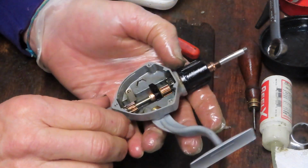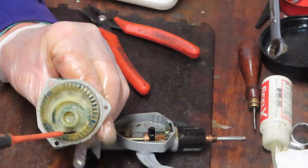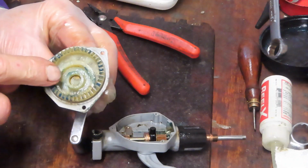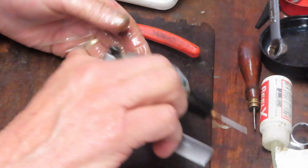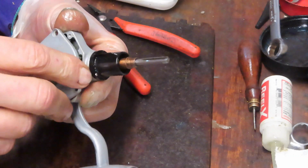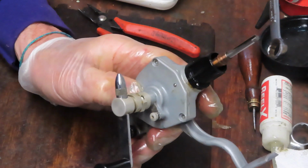Okay, we've got a yoke assembly. We've pretty much lubed up everything that's internal to this reel. What we want to find now is this is going to match into this groove right here with that grease on it. That's going to be our eccentric, and because it's offset, it's going to drive the reel up and down. And then we've got our keys here, which are going to drive off of that pinion gear. So at this point in time, we should just kind of find a way, visually sight it, and then we should be able to install our case, and without doing much, just see if it's working. Oh, look at that, working beautifully.